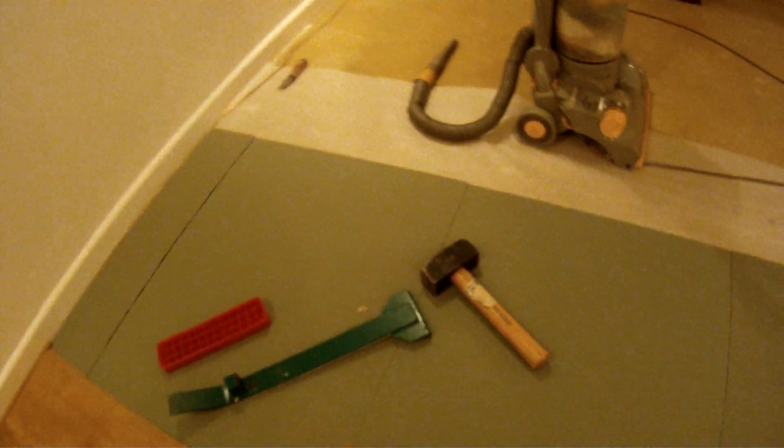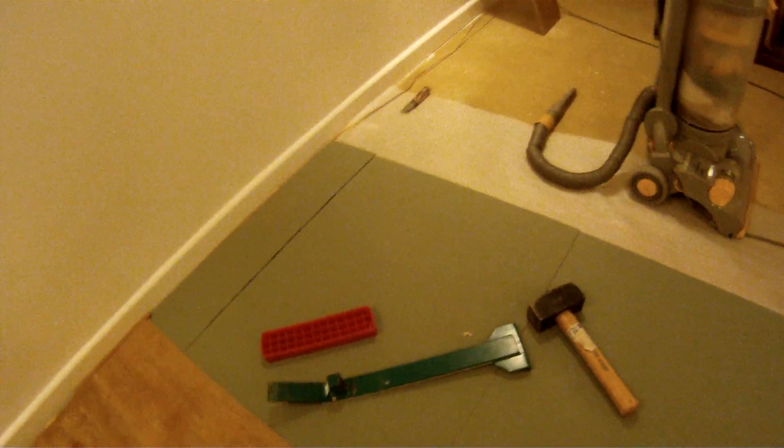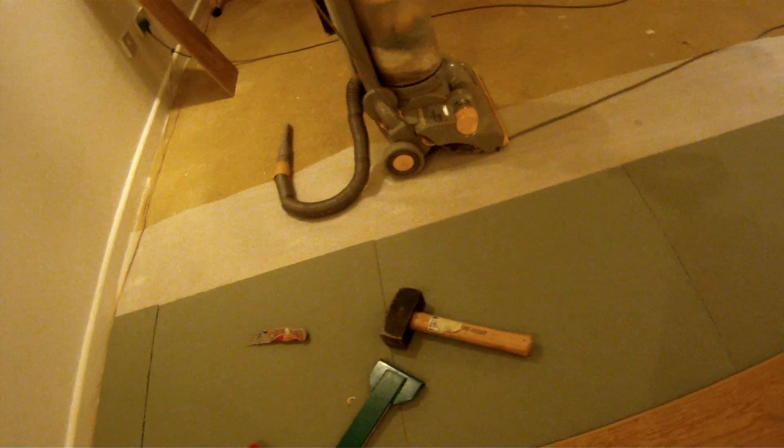Rather than being able to tap from this side — because the wall is going to be in the way — what you'll do is use this pull bar tool. Imagine the wall is there with your 10mm gap; you just hook that over the edge and give it a little tap all the way along. So another useful tool — that's basics: two or three tools, some cutting tools. A Stanley knife for cutting the underlay board — it seems to blunt the blade on every cut. The best way of cutting is to dig down as you go rather than go across, because it drags the fibre. Buy yourself a stack of Stanley knife blades and it'll make life a bit easier. Okay, thanks for watching — that's the basics of laminate flooring.